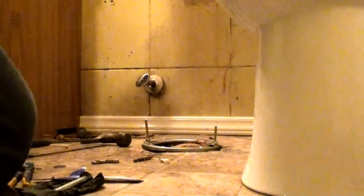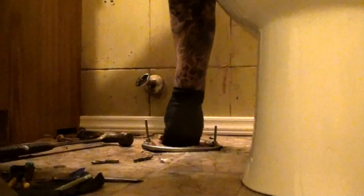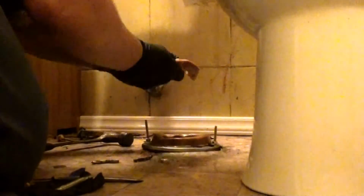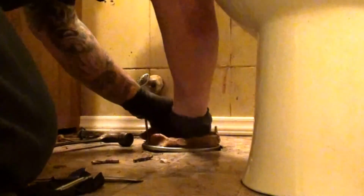It's a cast iron lead pipe, so I'm going to just drop that in place to somewhat keep and use that horn to our advantage. And that gives me something to smash my wax against. It prevents the wax from falling down inside there. We're actually going to have triple wax on here. Other one, instead of putting it on top of here to where it can smash in, I'm going to set it around our repaired flange. That way it smashes against there and ultimately gets a seal.